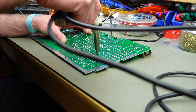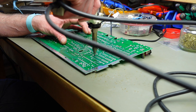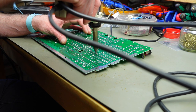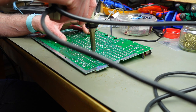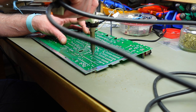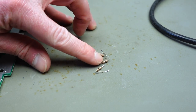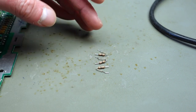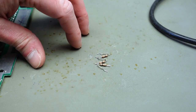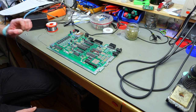The 130XE obviously has the exact same circuit board, but it has the position where the GAL goes in this mod already populated with the original memory controller chip used to switch the banks for the 128K. Here are the little jumper resistors — zero-ohm resistors. They only have one black ring; they're not used that often so they're kind of a curiosity. I'm going to keep these in my parts bin for future use.